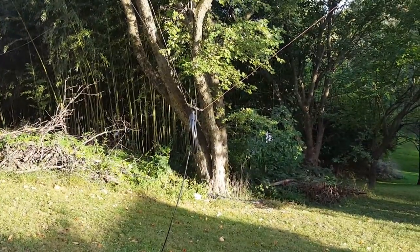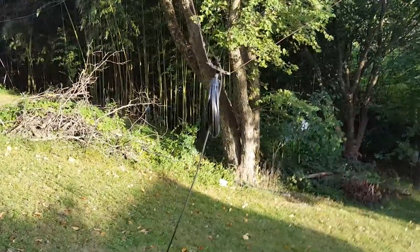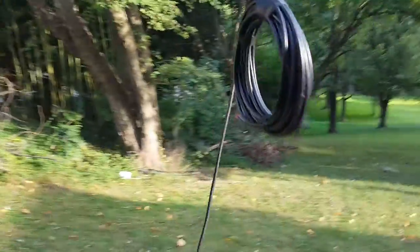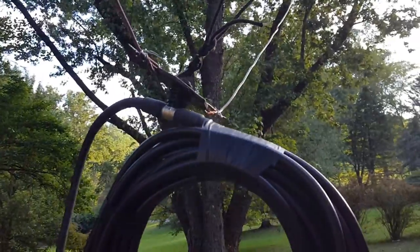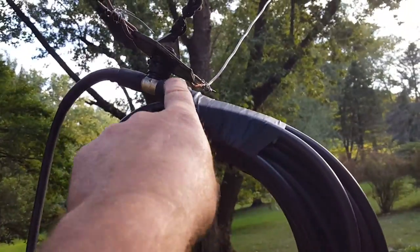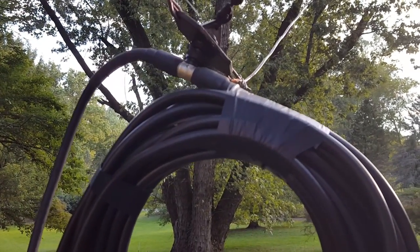I lowered my full-wave loop here on 75 meters, and what I found was my 75-meter tuning stub had an intermittent short in the connector. So I resoldered all the connections and got a healthier piece of coax.